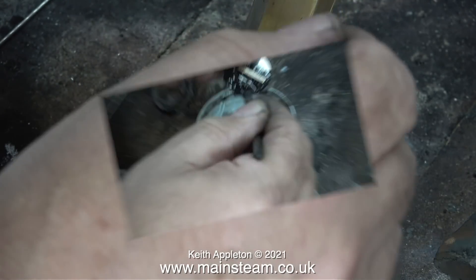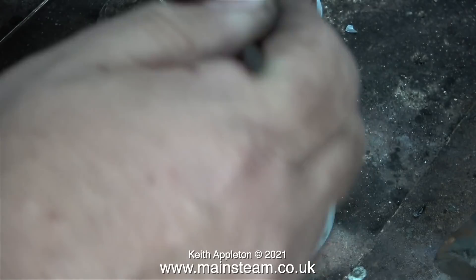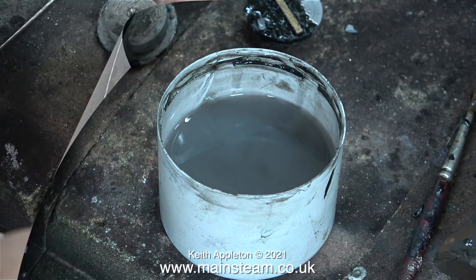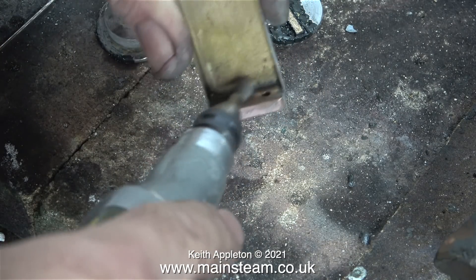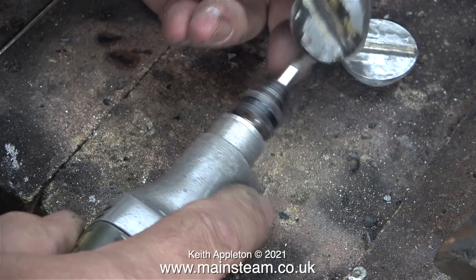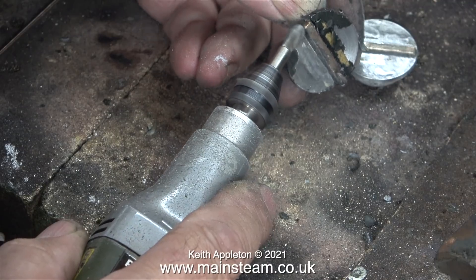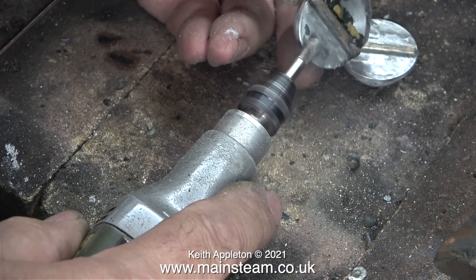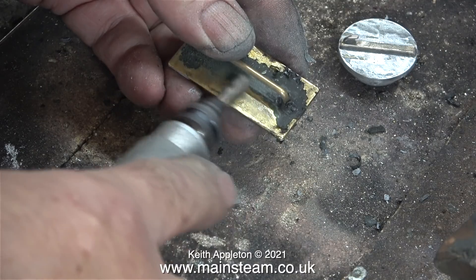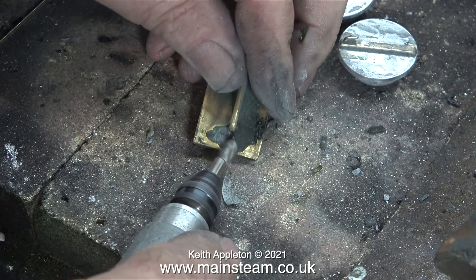I think this is still my favourite method of paint removal. If the paint doesn't come off in the gunwash, that's not a bad thing because it means it's really stuck to the metal — but all of this paint just fell off. I removed any small remaining flecks using a wire brush in one of my Proxxon motor tools. These two parts are the tank filler caps, and the construction is really puzzling — they're made from aluminium with a brass centre part stuck on with what appears to be epoxy resin. Once again, I'm seeing more than one person's workmanship on the same engine, though the main parts are quite well made.